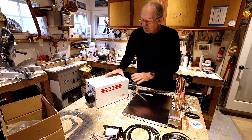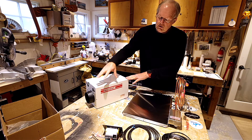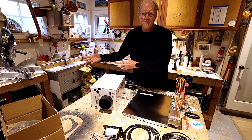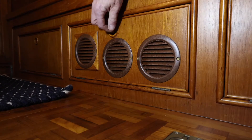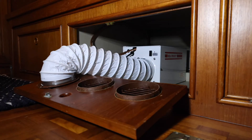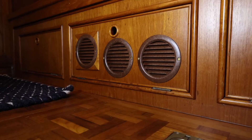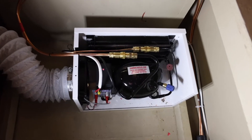As you can see on the right here, we have the condensing unit, and this contains the compressor and the condenser. This is Seafrost's BD unit. These are designed to go into a small locker somewhere where you have access to fresh air. The fresh air does not come from outside, but comes from within the cabin. So you'll have a little door here with a 4-inch pipe that takes the air from the cabin, comes in here, cools the condenser and the compressor, and then pushes it out through here.